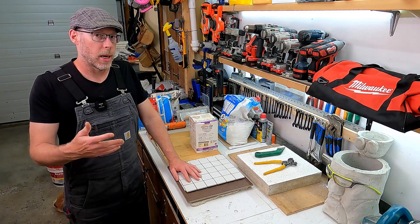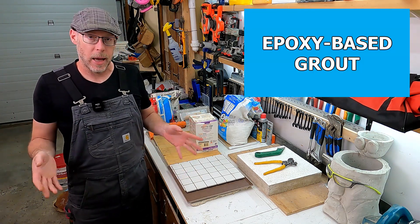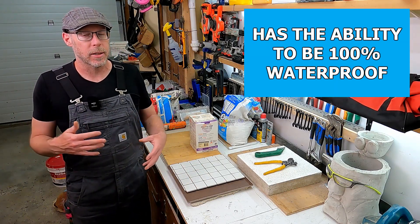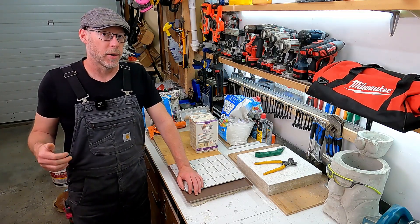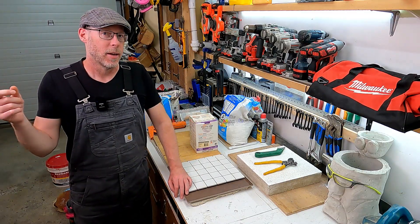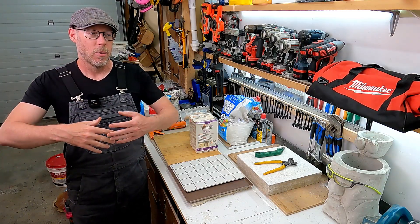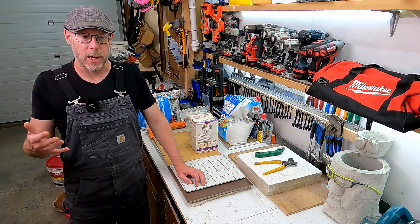The other kind of grout you might have would be epoxy grout. Epoxy grout actually has the ability to be 100% waterproof. It's a tall order — waterproofing is actually pretty difficult. My other YouTube channel is Swimming Pool Steve — look it up. It's a pretty big channel, and I definitely know a lot about waterproofing. The reality is that it takes such a tiny defect or flaw in the workmanship to compromise a waterproofing layer.